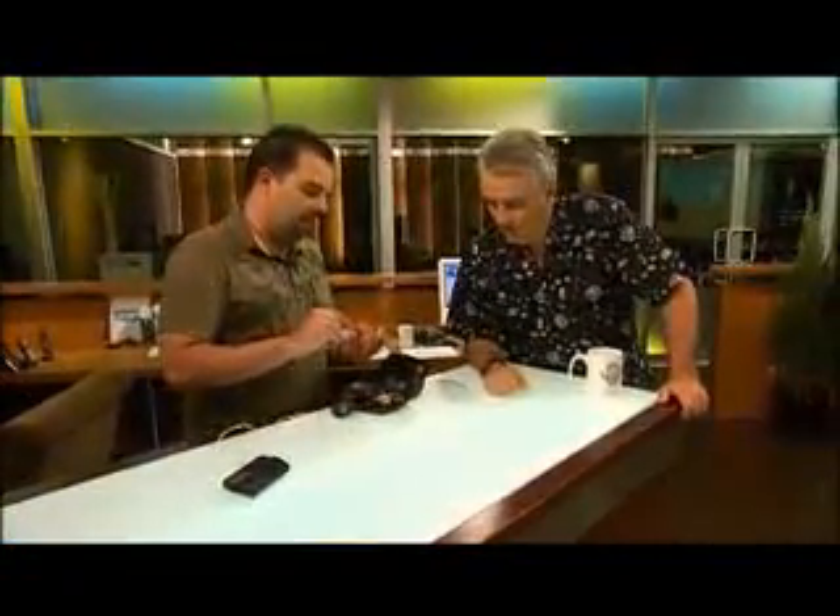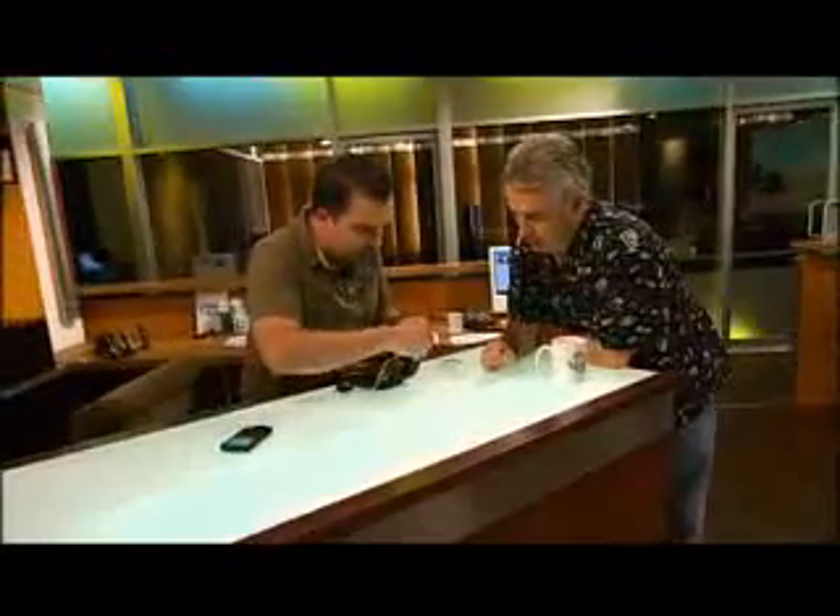Unplug the alarm clock before you do this. And the key to all this is something called the 7805 voltage regulator — that's this little thing. You can buy it anywhere from Radio Shack to any local electronics store. What this does is take anywhere between 9 volts to 12 volts DC and step it down to 5 volts DC — and that's what you need for USB. This will charge any USB device. You plug it into one of these ports and look, it's charging.